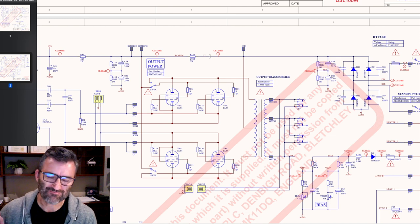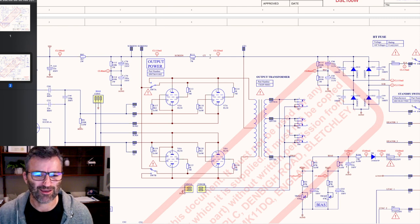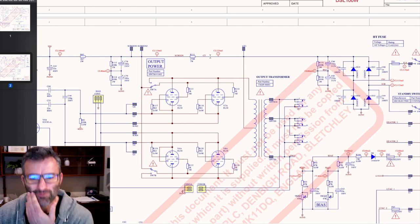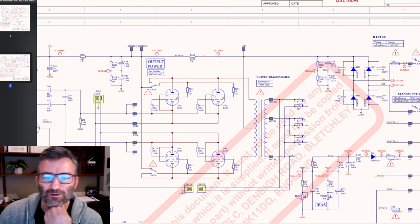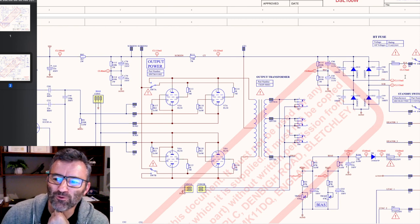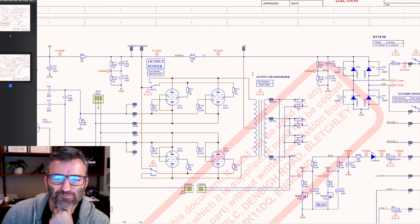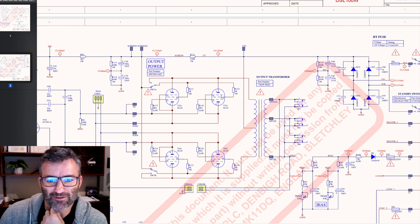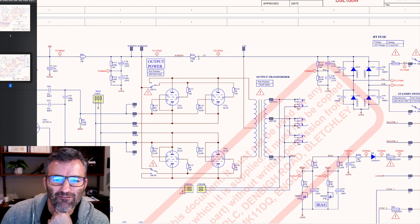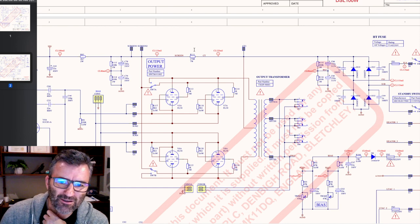So when your amp is under load, like you've got it cranked and you hit that A chord, what happens is these power tubes draw current. They suck current, and your power supply here is doing its darndest to give as much juice to these power tubes as they demand. So when you get a higher current flowing through this power supply line here, you're going to get a greater voltage drop.